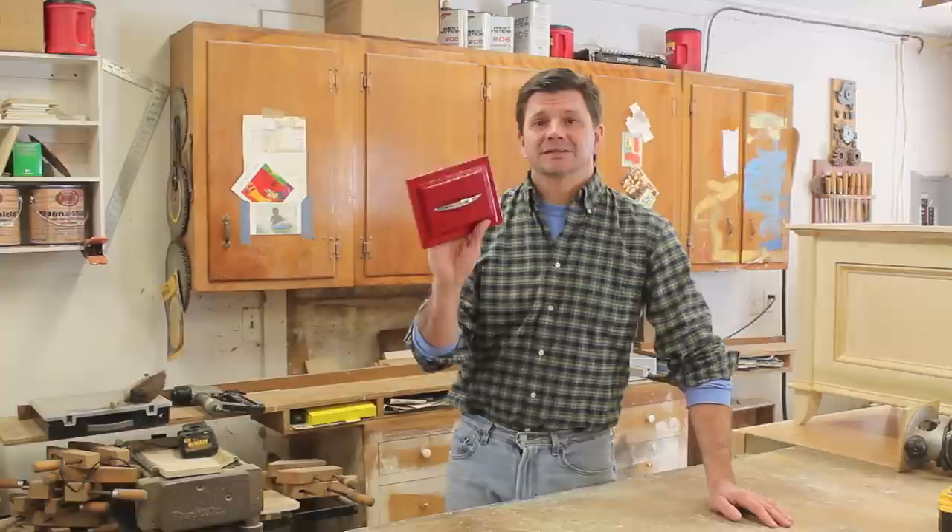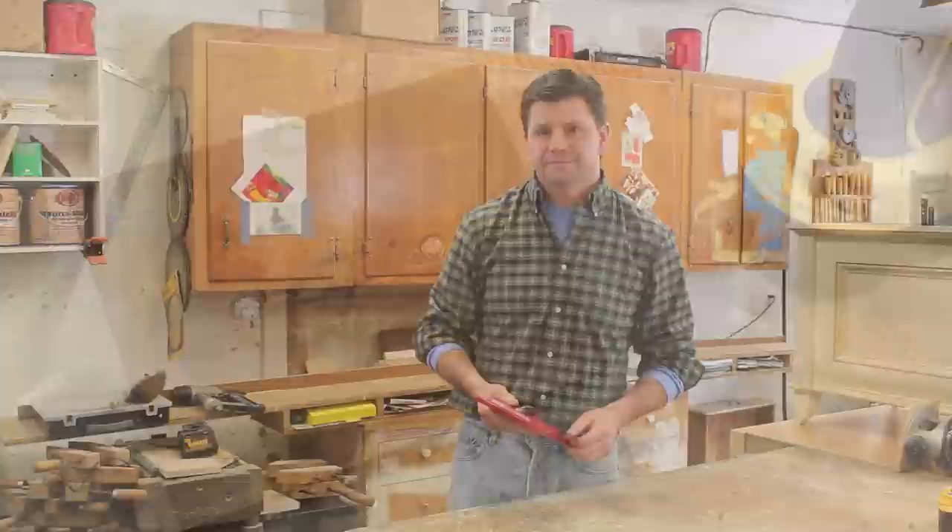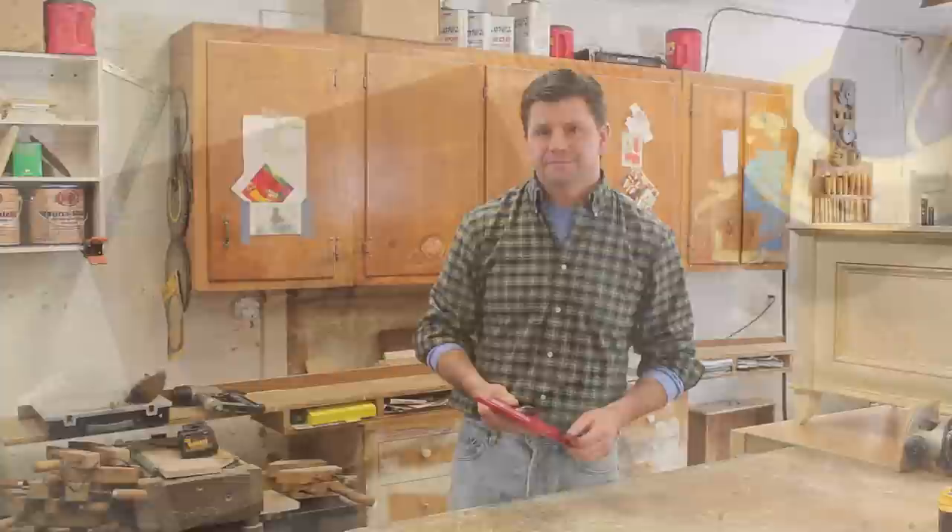So this is a good opportunity to show you exactly how I'm painting the cabinets step-by-step. The very first thing you want to do is remove all of the drawer fronts and the doors, and be sure to label them so when you go to put the kitchen back together you'll know where everything goes.